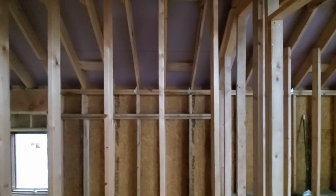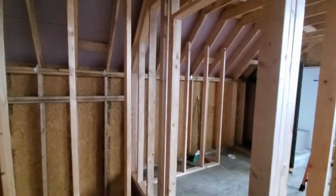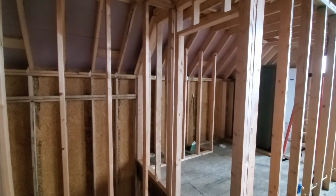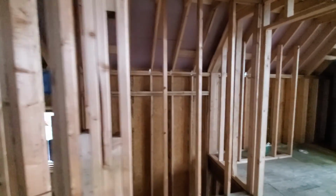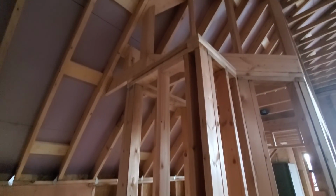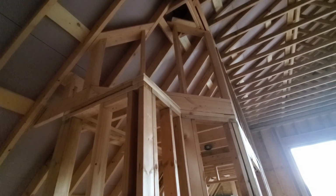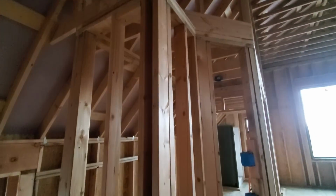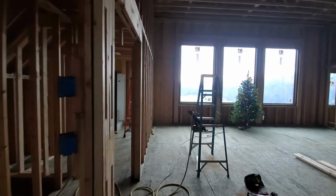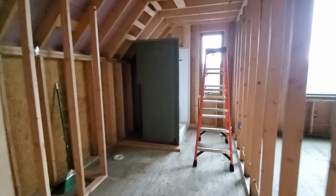One thing I wish I would have done was all these walls, just basically this whole corner and this section sat without this additional framing in it for months. And when I came back to finish this up the other day, it was so twisted and so out of plumb. I had to do a lot of work to try and get this to really line up the way I wanted it to and get everything back straight again. So I wish I would have just taken the time, a couple months ago when I actually framed these walls, to go ahead and finish it.